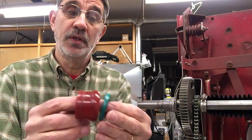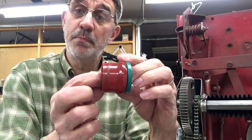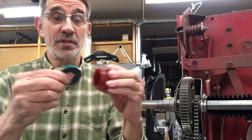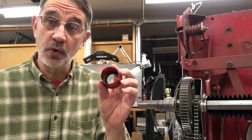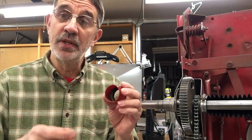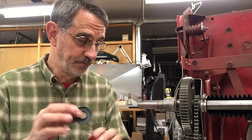If you notice, the dust cover in the back is bell-shaped the size of the seal and the front is not. So you can't just pull them out of there without breaking it. Soak it in hot water, it'll get very pliable and you can pull it right out. Throw it back into hot water because it's going to cool off quick, then press the new one in. Simple.